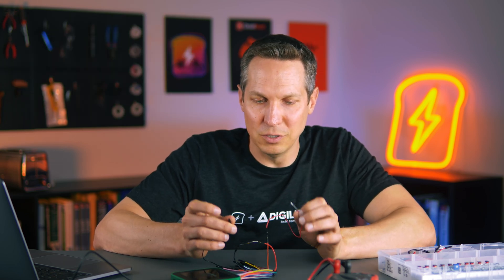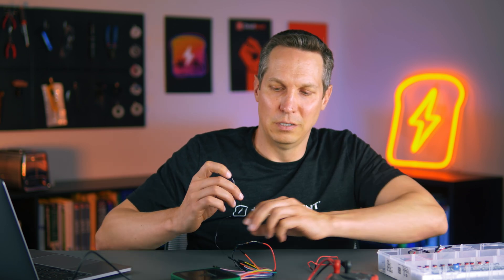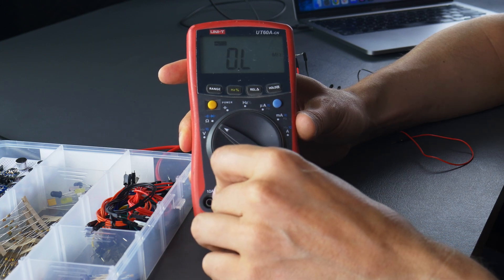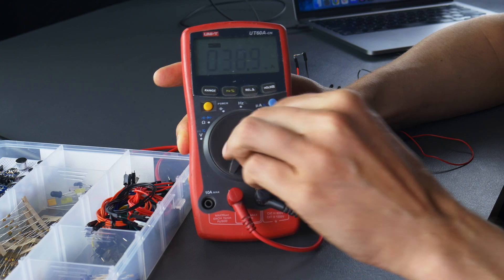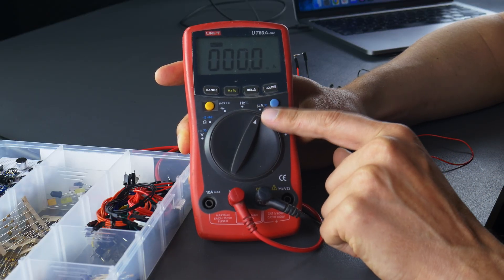So now we have measured the voltage as well. We've measured the resistance and the voltage, and if we knew Ohm's law that would give us enough to know the current, but we haven't gotten to that point yet. So let's actually use our handy dandy multimeter again to measure the current. We'll need to set it up again for current — take this out from where we were measuring resistance and put it back to where we are measuring current. Then we will want to change this over to microamps. If you're not sure exactly how much you're going to measure, you usually want to lean towards the larger side just in case there's more than you're expecting — you don't want to blow a fuse. But I'm pretty confident this is going to be in the microamp range.